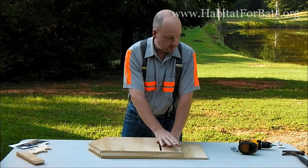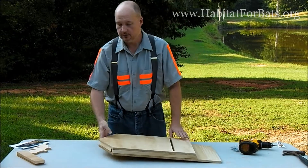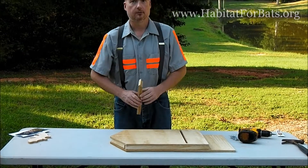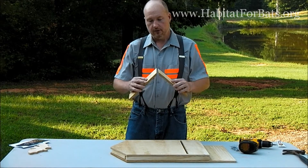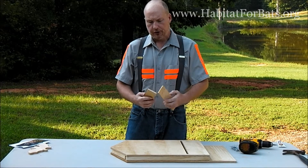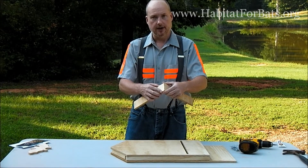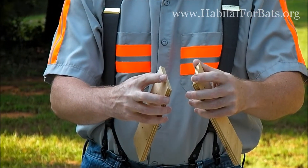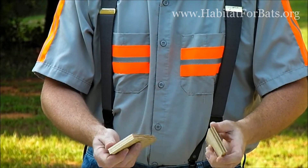The kids drill out the pre-drills and they assemble the house. They've caulked it, pre-drilled it, they put the screws in, and you get the body of the house. The roof was the most complicated part. This came about when Malia Bayless with BCI was helping get the house certified. We designed the roof as you would expect, with just a butted bevel. Her concern was that over time it could tend to open, and when people assembled it, they may not get it exactly pushed together and it would leave a gap.